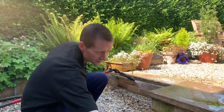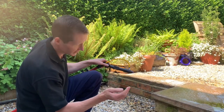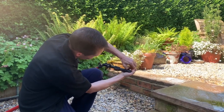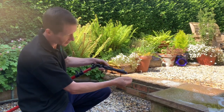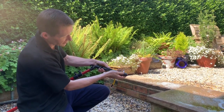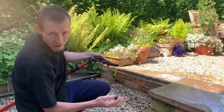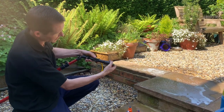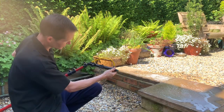So now we're going to demonstrate a number 10 fully cone nozzle running off a backpack and you'll see the difference. I'm just going to unclip the push-fit connector and pull the barb out. I'm using washing-up liquid here — if this were biocide or harsher chemicals I'd have the correct PPE on. For the demonstration I've already got an applicator with a number 10 nozzle in, which has a 2.8 orifice. The hole is a lot bigger so you get a bigger spray pattern — this is 70-degree, while the 6.5 is 50-degree. On a backpack you'll see the difference and I'll explain why.